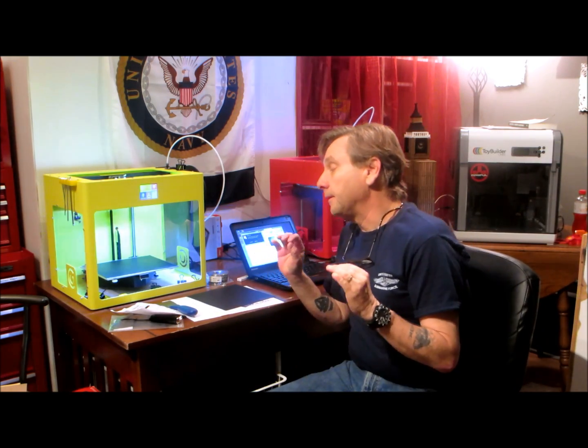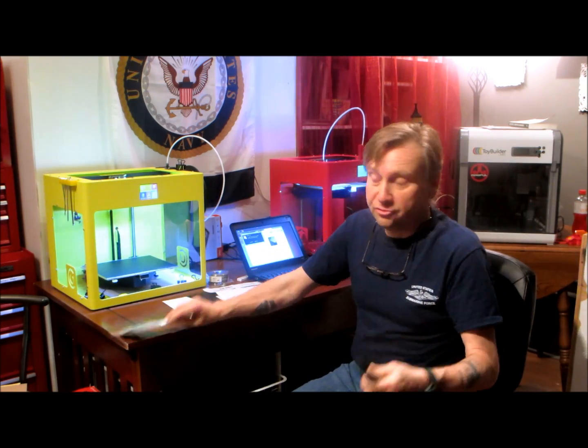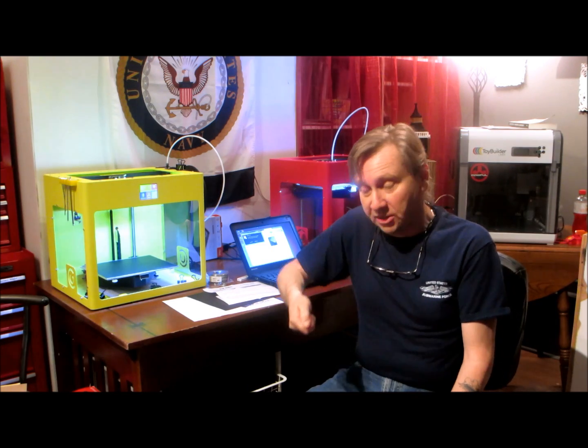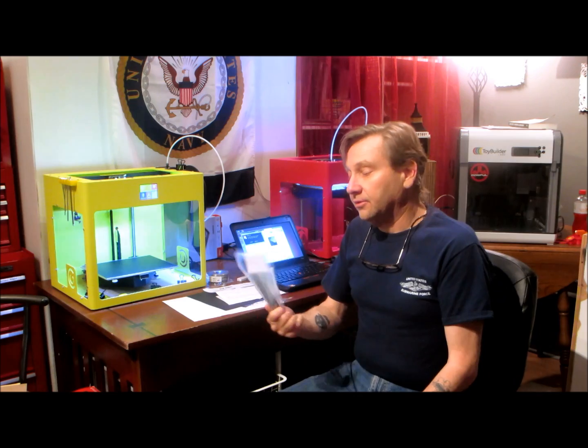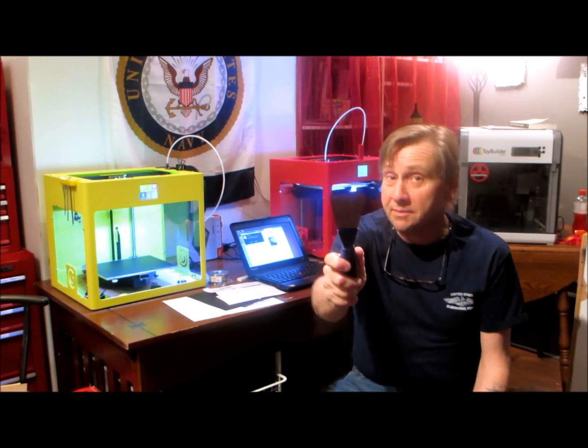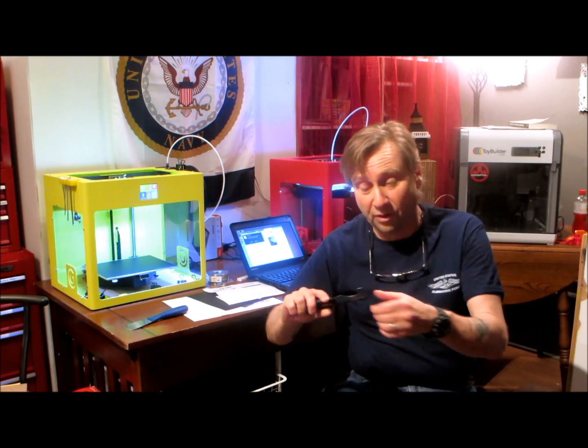Here's a little tip: I have several scrapers and spatulas. A lot of people still use the Cricut tiny spatula — it's about three bucks with a big long handle. I stopped using those. This plastic one came with the CraftBot — it's crap. I ripped the sharp edge off the first time I tried jamming it under something. The one that came with my CreateBot is basically a very sharp paint scraper — that's what ate my Kapton up. What I found at Home Depot is just a regular paint scraper. It has a fairly fat, sharp end, but nowhere near as sharp as a razor blade. It gives you enough grunt to get under stuff but isn't sharp enough to gouge the Kapton off.